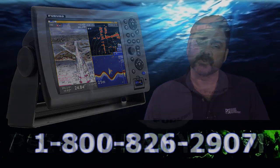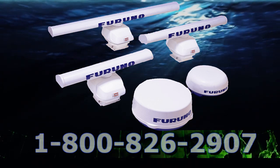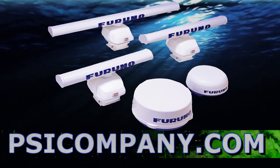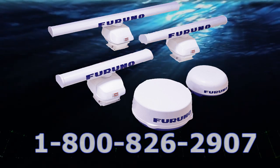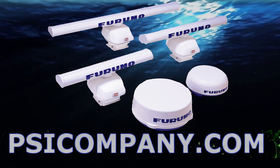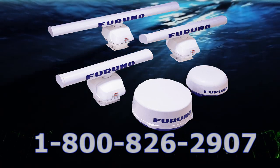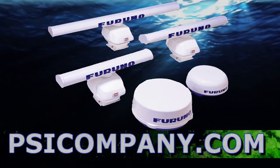The MFD12 is also used for a variety of other navigational inputs. The MFD12 can be used as a display device for the Furuno NavNet 3D radar sensors including the Furuno DRS2D and DRS4D, which are radome style radar sensors, and the Furuno DRS4A, DRS6A, DRS12A, and DRS25A radar sensors, which are open array style antennas. That gives you the capacity to go from 24 nautical miles to 96 nautical miles with power outputs from 2.2 kilowatts up to 25 kilowatts — a wide range of capacity and ultra-high definition sensitivity radar picture.